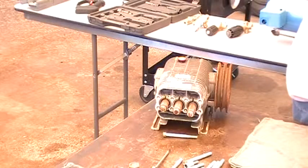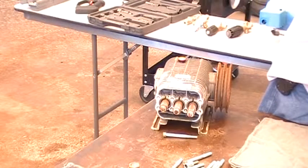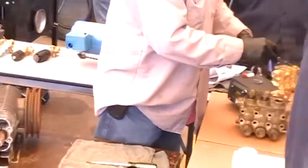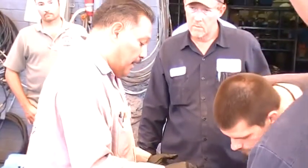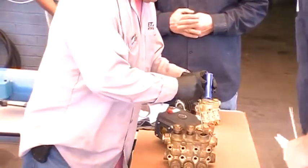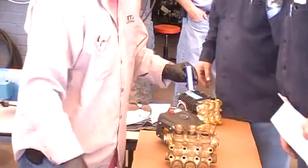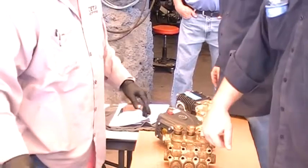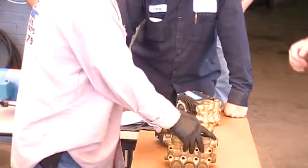You can see right here — see where the valve sits? You can actually feel it. See how the cavitation — so when this pump comes in, the first thing you want to check for is that you don't have that. This usually happens because of lack of water, and also lack of service. You can actually feel how it's worn.